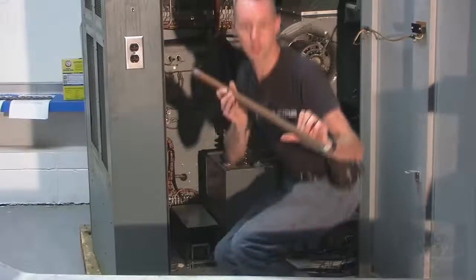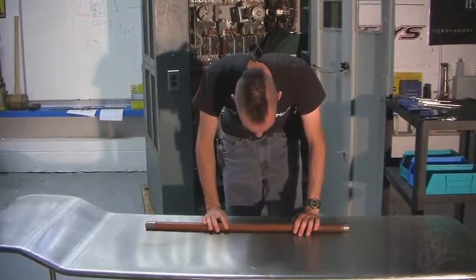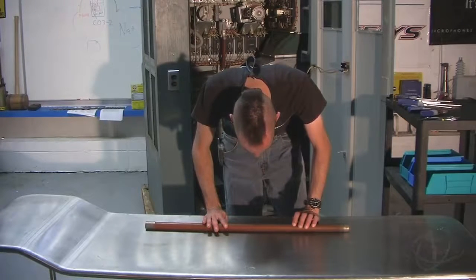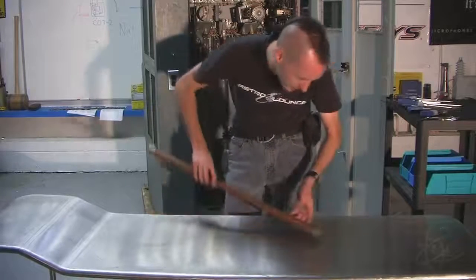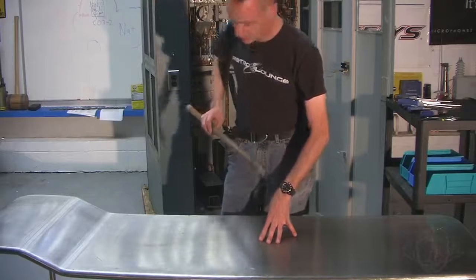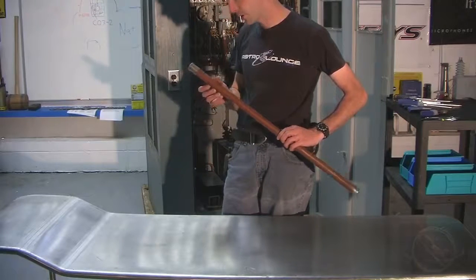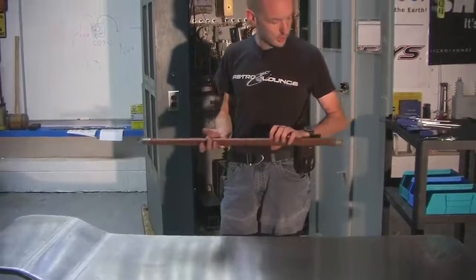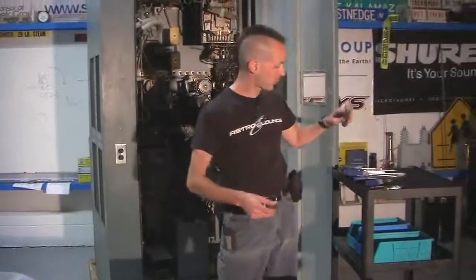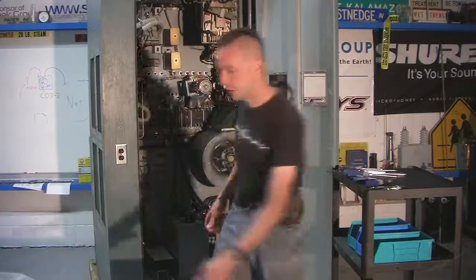This appears to be a really big fuse — it's either a fuse or a big resistor. It is a Westin model 985A, I think. It's a tubular resistor. At the bottom it is labeled 1 milliamp max, 20 kilovolts max. It's a Westin MFE206 — and now you know everything about it that I do. So if anybody has any details on this, let me know. We know it's a resistor and it's easy enough to measure it out, and we know it's good for up to 20 kilovolts. That's our first interesting piece.